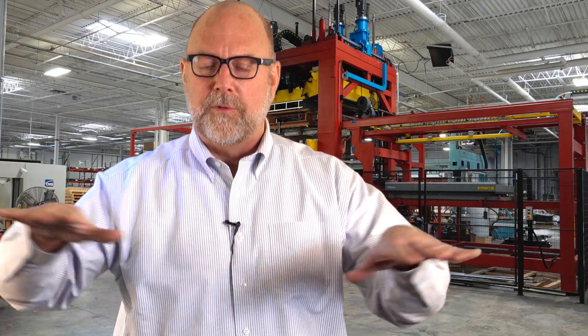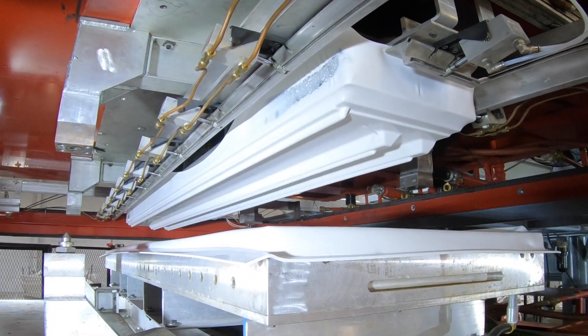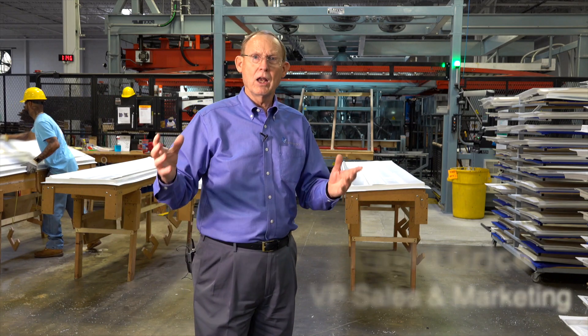So thermoforming doesn't use melted pellets — what does the raw material look like? Thermoforming takes an extruded sheet, anneals it to a zero stress state where it's just below its glass transition point, and then thermoforms it around a tool that's typically about 160 degrees Fahrenheit. So you form it around a tool — with pressure or with a vacuum? All of this is vacuum forming. The material is heated and then vacuum evacuates the trapped air.